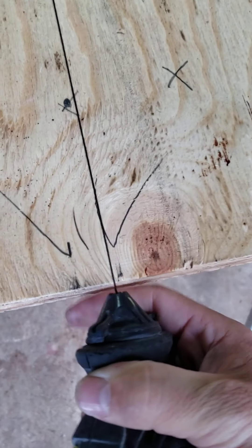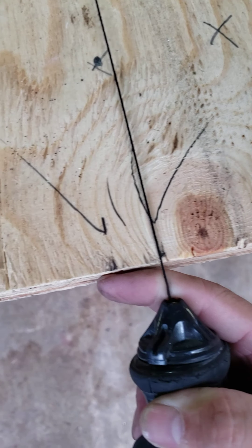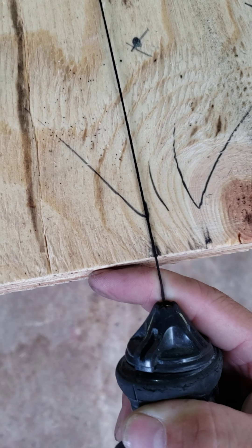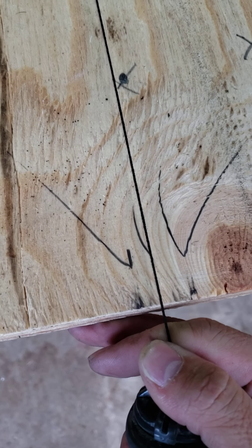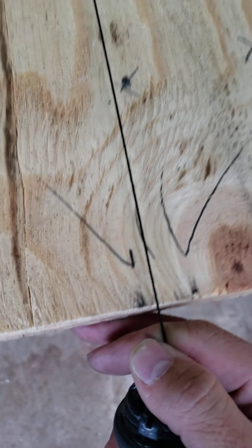So this crow's foot — you go right to the center. This one, you go right over the line. You don't see this one as often, but I was shown this as an apprentice myself. And then you have a little tick mark. The problem with a tick mark is it's hard to know — unless you made the mark yourself — which side to go with.